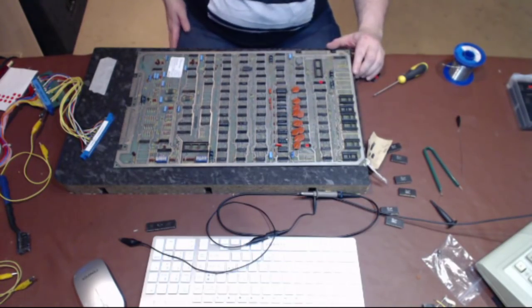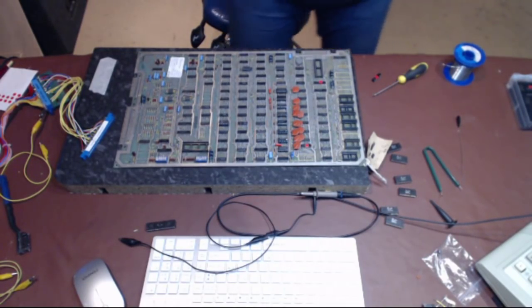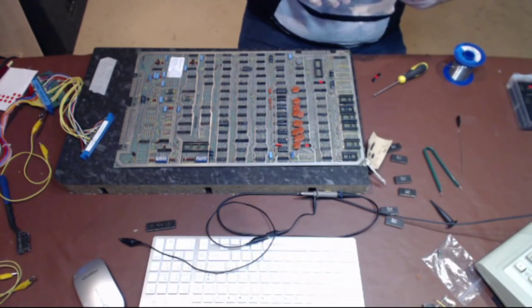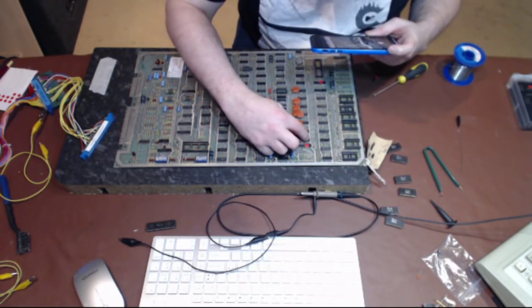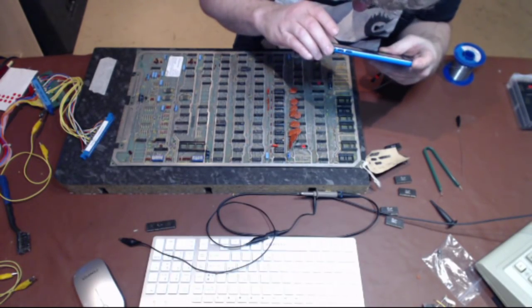So what I'm going to do here is I grab my phone at this point. I will just have a quick zoom in on that chip socket, where that was. Like I say, pretty convinced that it's not actually that one. If anything, it's probably going to be the one right next to the CPU. It's going to be this E2 chip, if anything. I can't see it being this one over here. Move these caps out of the way carefully. Fold them back down afterwards. There's a decoupling cap, so it wouldn't matter anyway, but no.